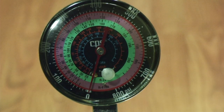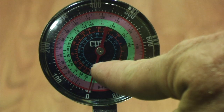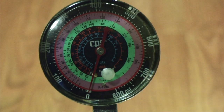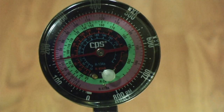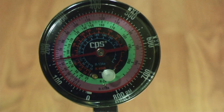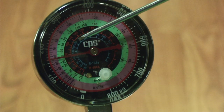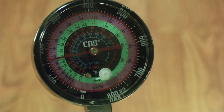I've got this zoomed in. If you look on the gauge, I've got a pink line that's got R410A, a green line that's got R22, an orange line with 404, and a blue line with 134. Once you have your gauge hooked up to your Freon tank, you turn on your tank and you see where your needle intersects — we're doing R22 — so I want to see where my needle intersects the gauge, and it should match the temperature that's on your tank. Right now it's 86, 85 degrees. I'm off just a smidge, not much, so I'm going to leave it alone.